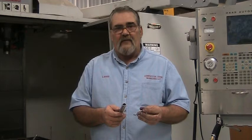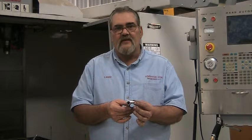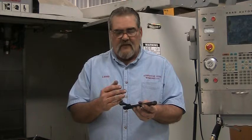All of our actions — and we also have them available as Remington replacements — feature one-piece bolts. Typically in the industry, most bolt handles are either bolted, silver-soldered, or welded onto the bolt, and these can break under severe use in the hunting field or in tactical applications. All of our bolts are one-piece: the bolt, handle, and all are machined as a single unit — there's no way the handle can shear off or fall off.